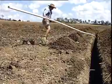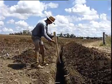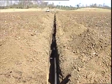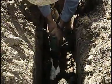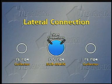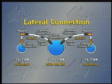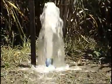Polyethylene may also be used. Once the lateral lines have been laid, the next step is to dig trenches for the sub-main and collector pipes. The sub-main and collector are usually made up of PVC piping, which is ideal for drip irrigation purposes and is the most cost effective. Once the sub-main and collectors are installed, the laterals need to be connected by drilling holes into the PVC pipes. A start connector is inserted into the hole, a small section of blank tubing is attached to the start connector, and this is then connected to the lateral dripper line via an adapter. The system then needs to be flushed to remove any dirt that may have entered the tubing during installation, gradually introducing water while one line is left open. The trenches can then be covered in.